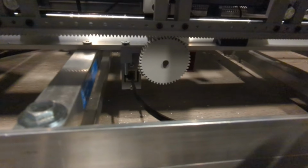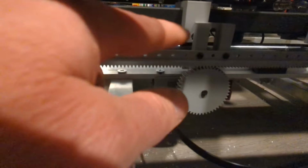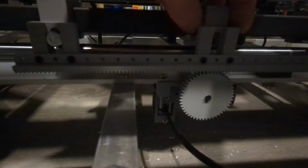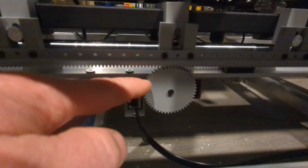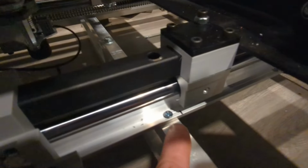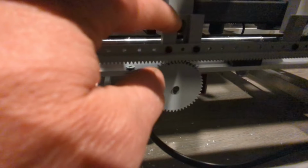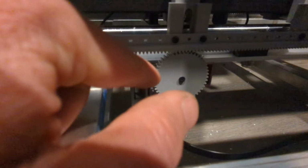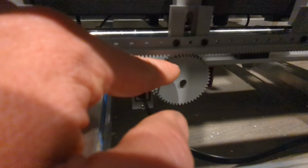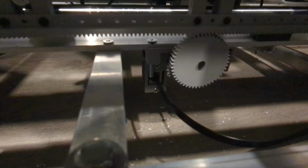Alright, I've got the new gear installed with these new brackets here. And I intentionally left this middle one undone because I wanted to center the sensor gear. And what I've done is I've marked with a Sharpie the exact center point of the surge, and then with this bolt being out, I'm able to lift the rack up slightly and rotate the gear, skip a couple of teeth in one direction or another until I find the center point on the SMC3 app.